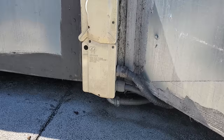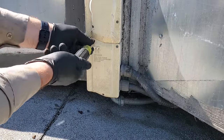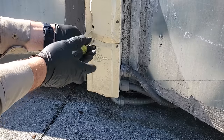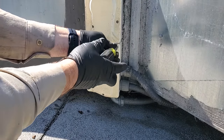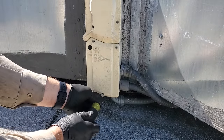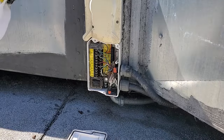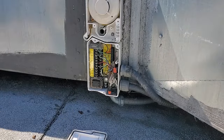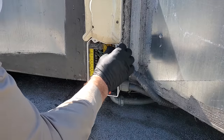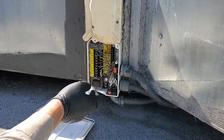The rest of this is just going to be test and reset stations, and then we have an alarm contact right here. There's another smoke detector here — this one has the black cap. Let's see what's going on in this one; it should be wired in series with the other one. There's water damage in this one too — not like the other one, but lots of condensation. Not good. And there's our end-of-line resistor right there.